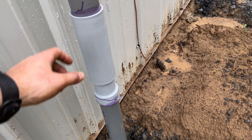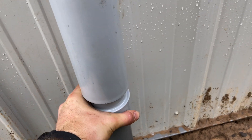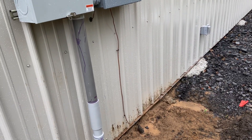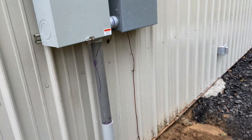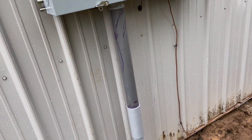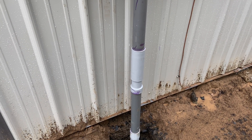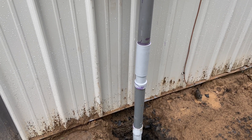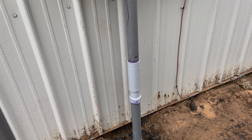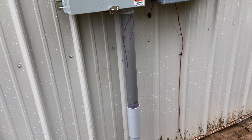This fitting here is important — a lot of people forget this. It's called a slip sleeve or expansion coupling. As you can see, it moves. The reason you want that is if the ground shifts at all and you've got rigid pipe buried connected to a rigid box, something will break — probably the plastic pipe. The expansion coupling allows the pipes to give a little bit. A two-inch one is about $20, which is a little expensive for a PVC fitting, but better to do it once and do it right.